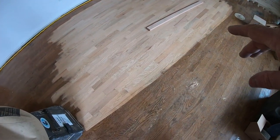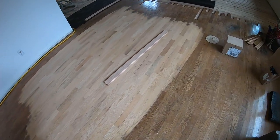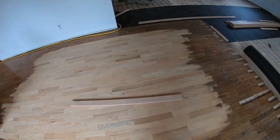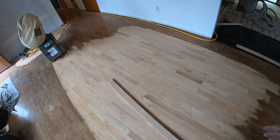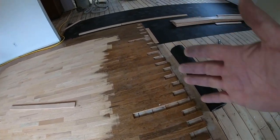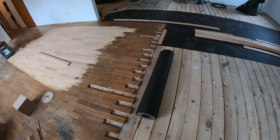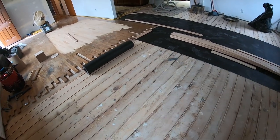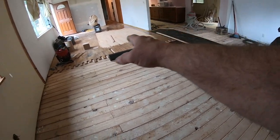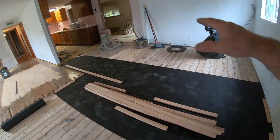So you can see what we have here is a red oak shorts floor, which is kind of rare. Usually they're red and white mixed, but this is all red. There are no shorts available at all four distributors in Seattle right now, so I cannot find this wood to match this floor perfectly. We have to take what we can get sometimes. The homeowner has agreed that we're just going to put in some random length. We're going to tie it in here — you're going to see a little difference in the two types of flooring. But by the time you get the furniture and everything all in, it's going to look great. So we're going to start off our first row, do our feather all the way across this room, slip tongue it or spline it, and go ahead and do that kitchen.